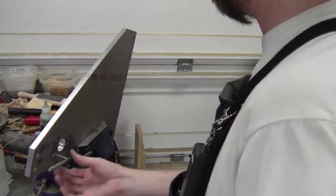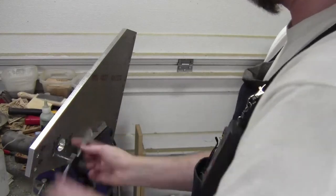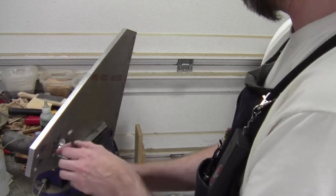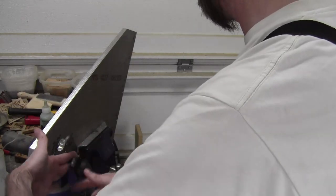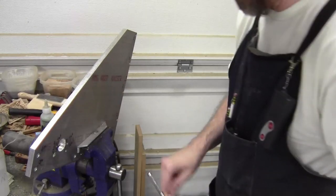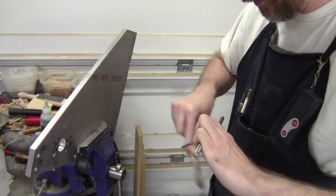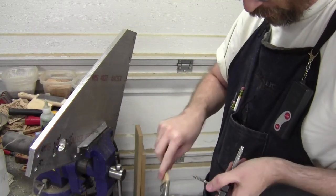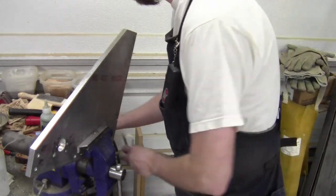And just to prove it, I'm going to go get one of those 5mm screws and make sure that I just didn't thread this wrong and make a mess for myself. But I'm pretty sure it's okay. There we go. Yeah. Let me clean this up real quick. I'm not going to say anchor lube is the best thing in the world, but it was better than mineral spirits in a 10-32 tap. Yeah, okay. So I'll bring you back as I tap the rest of these here.